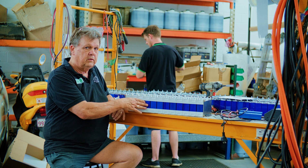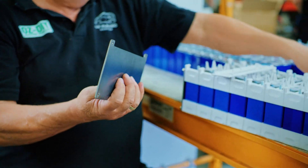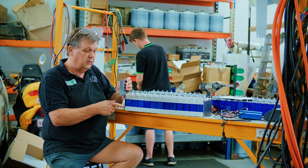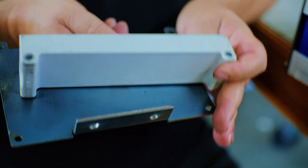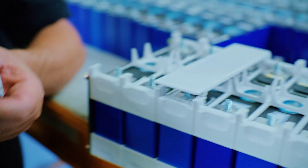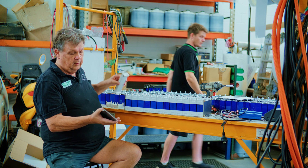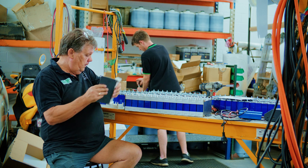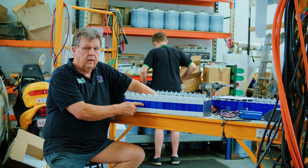If you went say 10 cells you'd be well within your 20g limits as far as safety goes. We also made something called a bookend — a very simple thing with two bolts through from underneath to hold it to the floor of your battery box, with threaded rods going through either end. In a long string, every 10th cell I'd put one of these in. The bookends give you a gap between the cells.